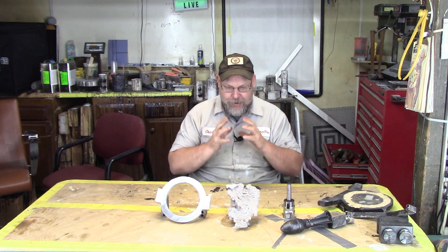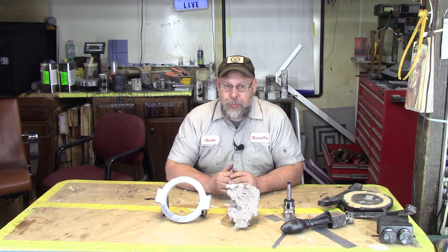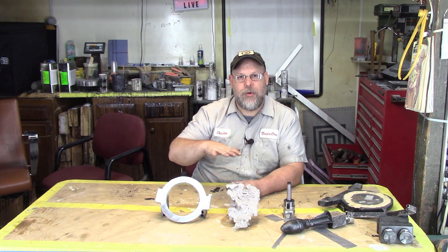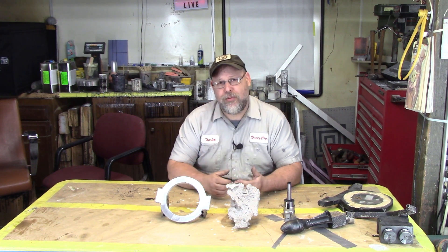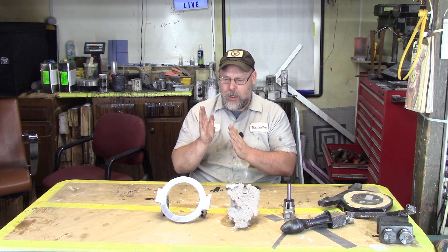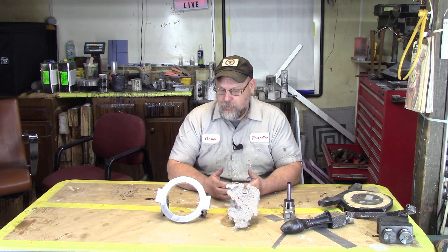I knew it wasn't so wet that it was going to be dangerous causing aluminum to splatter out of the sand. But what it did do — we believe it re-wet the slurry coat on the part, and as soon as it got hot that built steam and opened up pathways for aluminum to flow out of the form. Then it got into the moist sand, more steam accumulated — not boiler steam pressure explosion, but enough to separate the sand and allow material to push through.